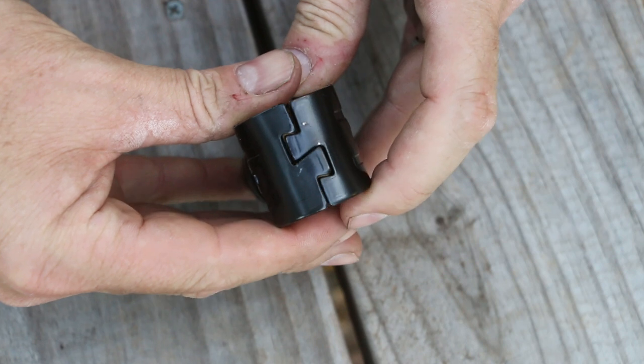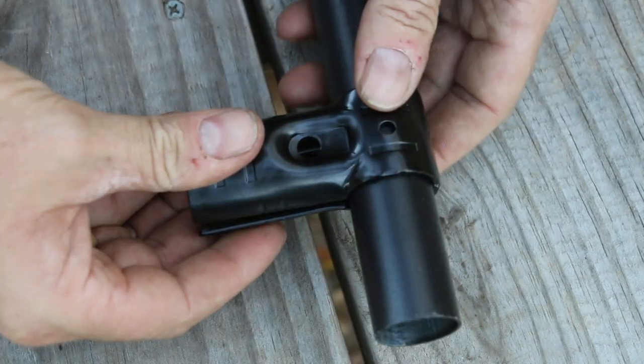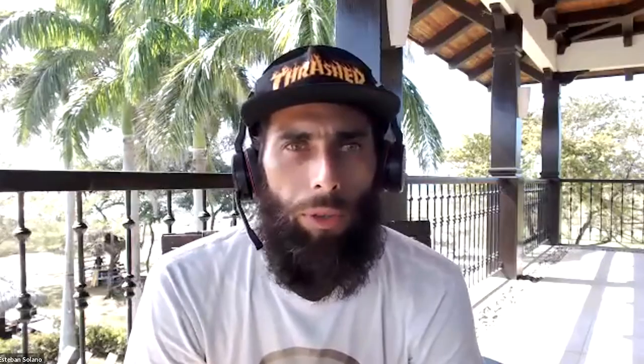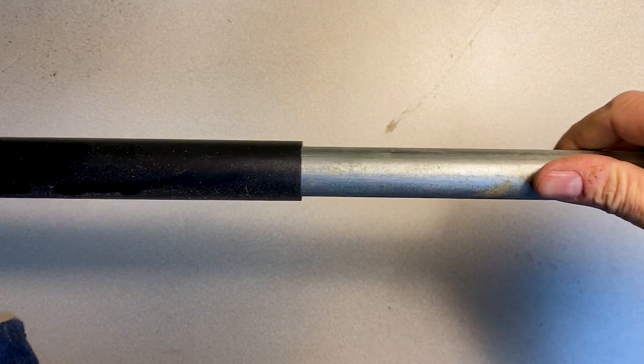One of the things we're considering is the ability to use three-quarter-inch electrical conduit — I know you had some new spacers coming out that we're going to utilize as well. I'm thinking of using the conduit for the hidden portions of the skeleton, and then the one-inch Tinktube pipes — probably black, because that'll go nicely against the aluminum — wherever I have exposed piping. We do have the adapter available now to incorporate three-quarter-inch conduit with Tinktube. What's also really cool is that you can slide three-quarter-inch EMT conduit inside the one-inch Tinktube pipe, which opens up all kinds of pullout features and other ideas.